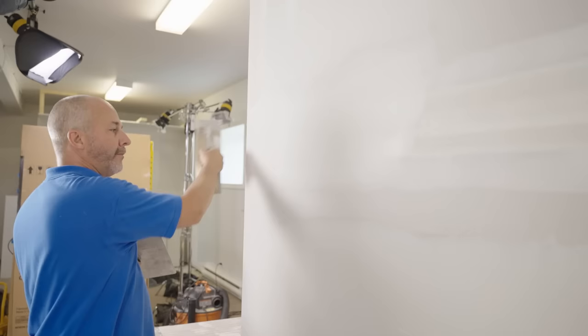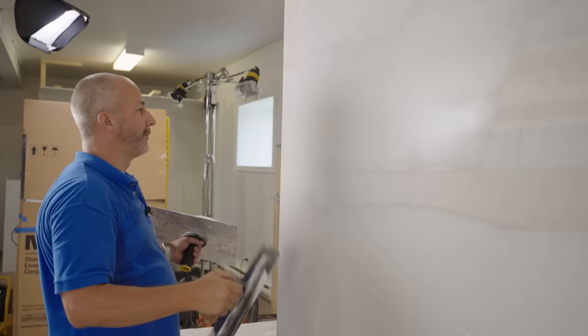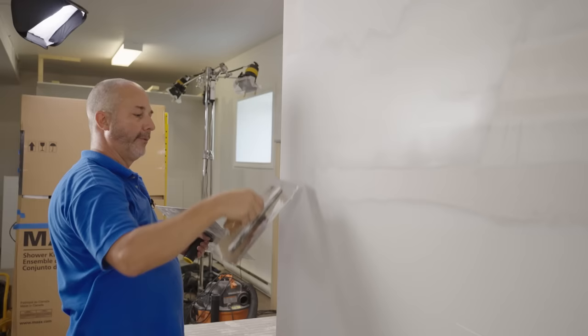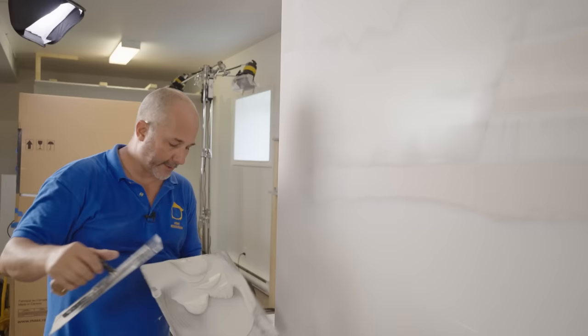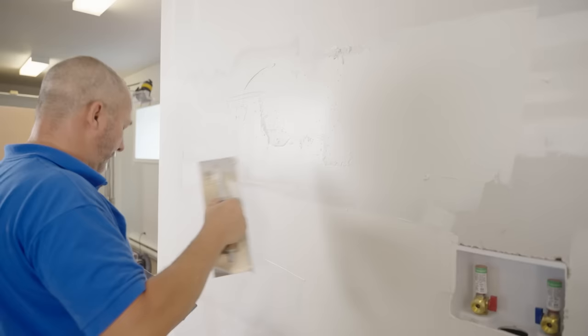Remember, it's really tricky to do this because you're supposed to do joints and corners. They're in different directions. You should do them on separate days traditionally with drywall. So when you're doing them all the same time, multiple coats a day, you gotta adjust how you're working and leave a ridge that can be sanded off. That's really all there is to it, all right? Leave a little extra work to do with the sanding, and that'll save you a day of letting it dry and then recoating.